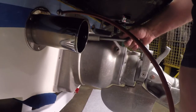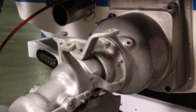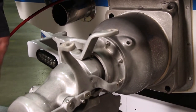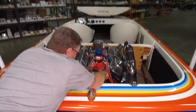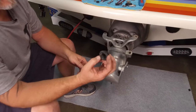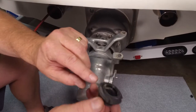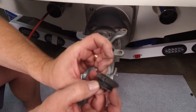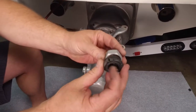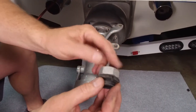Now let's give the steering cable a push — it's out and we'll just set it down in there. This is why you get a new steering tube bushing whenever you do a rebuild or take the pump apart. This one's pretty well shot. You can see where it would have been leaking in all these spots. It starts off as a piece of tube about this long, and those little grooves in the nut actually squeeze it up to create the seal to the transom assembly.